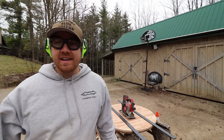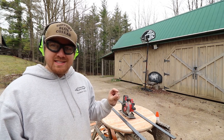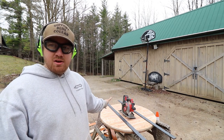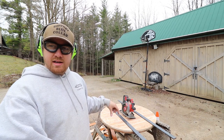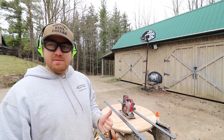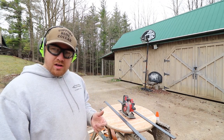Way longer than I would have expected, but I guess that's my fault for using a palm sander and not pre-planning this stuff. Alright guys, now that it's all sanded off, I've traced out two pieces of steel — they're two inch by three-eighths inch thick. I've evenly spaced them across the top. What I'm going to do is set my circular saw to three-eighths after I've traced these out, cut that, chisel out the remainder, and then drill holes in the steel and epoxy down the steel itself. That way I can put screws right through the hardwood into the plywood — it'll look like two steel bands on the barrel. It also gives me the added benefit of holding this thing all together really well between the epoxy and the screws. Hopefully it works out good.